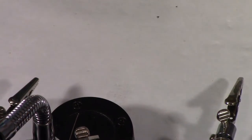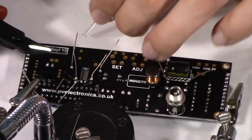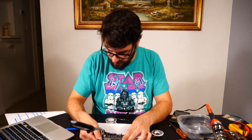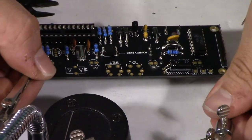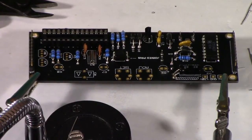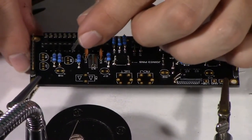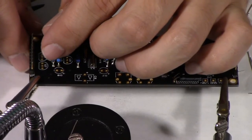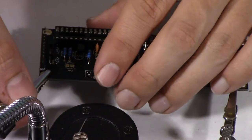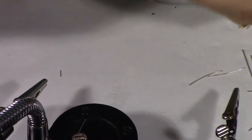Now let's check them out — we are literally in the home stretch here. Q6 through Q8 are the three remaining transistors. They all look like the voltage regulator but they're not — they're dirty liars. They're all the same component. We've made sure that the rounded bodies match the PCB silkscreen. Now we're going to solder.